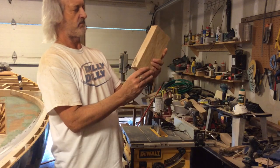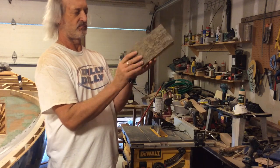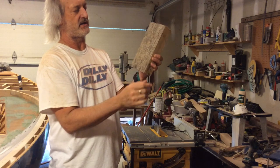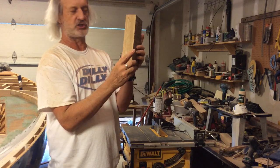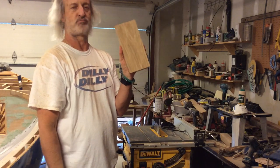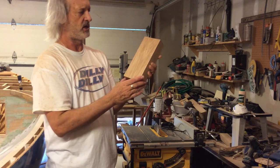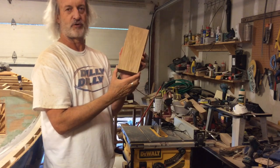And there we have it. That piece came right out of that piece of oak that's been holding the garage door up. Great dimensions, no checking in here, and I like the way the grain is on here too. I can smooth that down — it's just weathered a little bit. It's about nine and a quarter inches this way, right at 2 inches thick, and about four and a sixteenth wide. This is perfect. We'll need to dig out a spot where the mast fits in and look at the plans to see exactly how that goes, but we've got a really nice solid piece of white oak for the mast step. If at first you don't succeed...